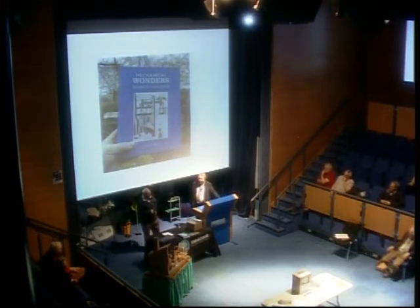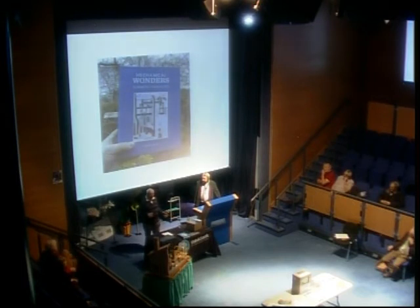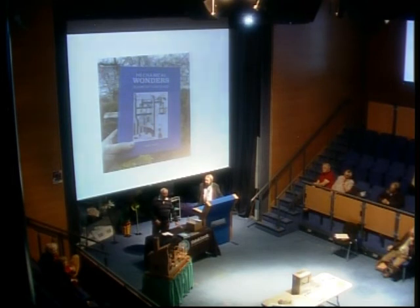The interesting thing is that I made that brick-making machine that you see there at the same time as we were introducing into the pottery industry dry-powdered technology. And I was responsible for the development of these machines. They were made in Germany, but I was jointly responsible for the design of these machines. And a patent was taken out for the method of operation of my brick machine, which was applied to the machines that were used in the pottery industry. Because when you're developing something at home, you've got to make it with what you've got, haven't you? I found a very simple way of metering the correct amount of clay each time, and that was applied to the full-size machines in the pottery industry. The machines were supplied from Germany without all this metering device on, which we put on, which is a copy of my brick machine.